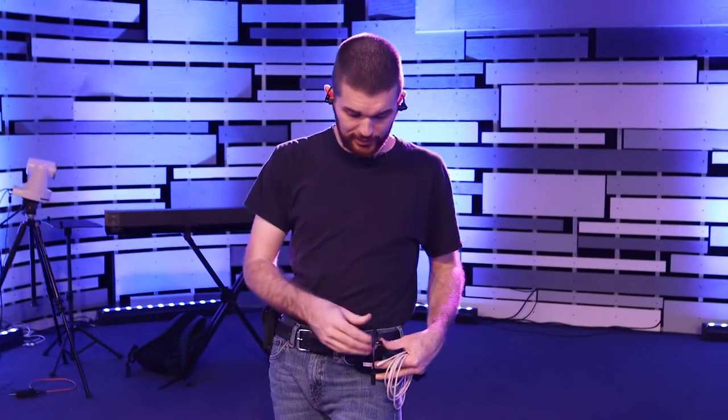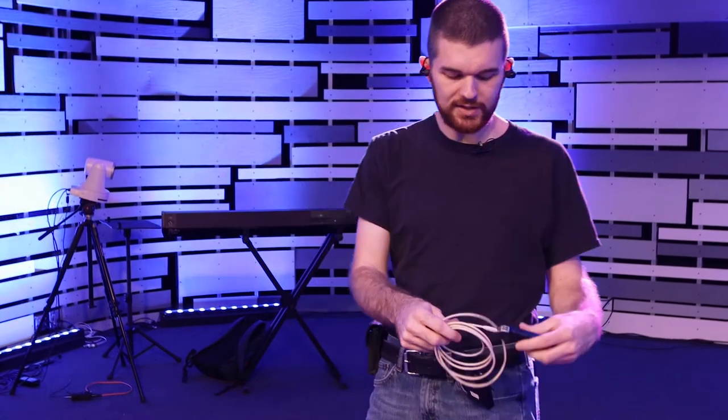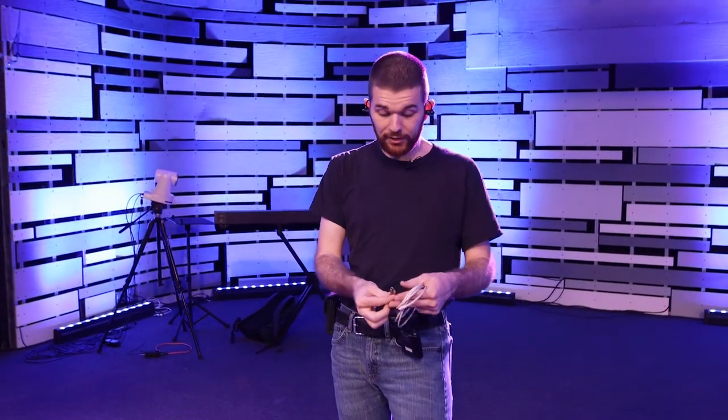If you don't want to mess with Y cables, reconfiguring things, or other recording techniques, I have a final thought that is super simple. By going straight out of the wireless body pack or personal mixer where the eighth-inch jack normally plugs into your in-ears, you can add a Y cable there and record directly into a smaller recorder like a Sony or Zoom H1N. They are super reliable, use one AAA battery, and can record for lots of hours. So literally, plug this splitter into my body pack, plug in this aux cable, send it into this little recorder, and the other side of the cable plugs into my in-ear monitors.